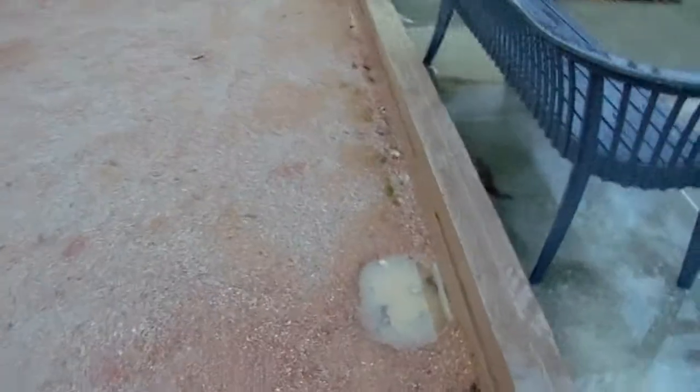Fines are the 100 and 200 count sediments. You can see this is after more than 10 days of on-again off-again rain, and this court is still pretty hard and obviously not draining very well. If this were decomposed granite, or a decomposed granite and oyster shell blend, this court would be draining well, it would be easy to maintain. We can see the result of the water puddling up — it's not easy to maintain.